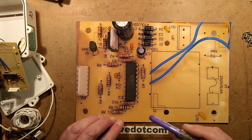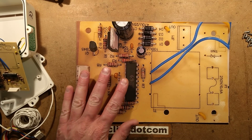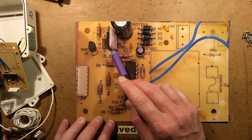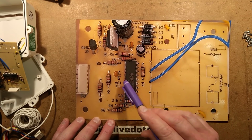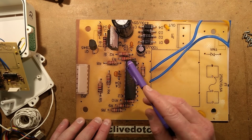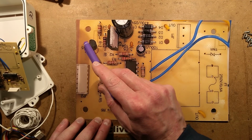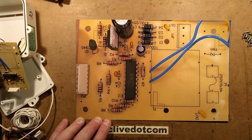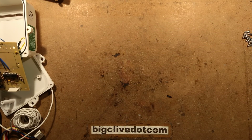I could doodle this down actually. Where have I scribbled this schematic out? Tell you what, let's walk over all the things first. We've got the rectifier, the smoothing, the regulator, which brings it down to 5 volts, the microcontroller, the reset circuit, and then all these little 1K resistors going out to the display, and I've worked that out as well, and a transistor. The transistor and a couple of these 1K resistors are part of the circuitry that goes to the output to the antennas, if you could call them that.